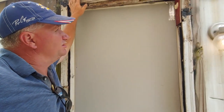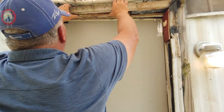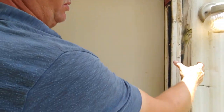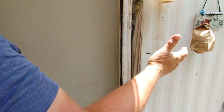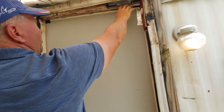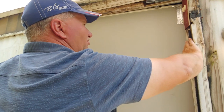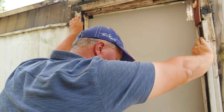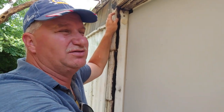Hey, you're here. Guess what we're doing. We're working on an exterior door that has been replaced and it's still leaking — I suspect from above. Looks like they put a 1x4 so that it wouldn't be built up on the inside, which you would rather have built up on the inside than on the outside. Because if you notice, this is all rotted out because of the water running behind. So we're going to fix that. And you get to see how you can put a house-type door in a mobile home. This has already been done, so we'll show you how to open up the upper part, but we're probably going to have to replace some two-byes around the outside edge.